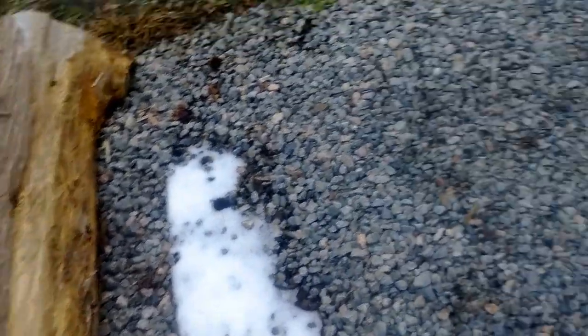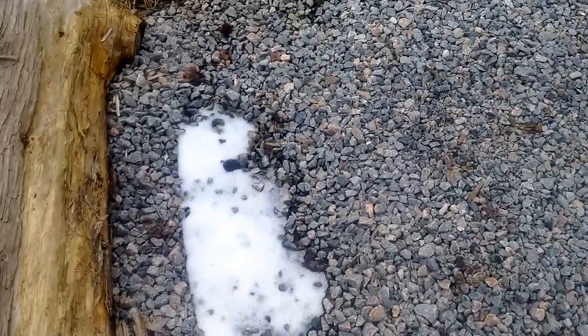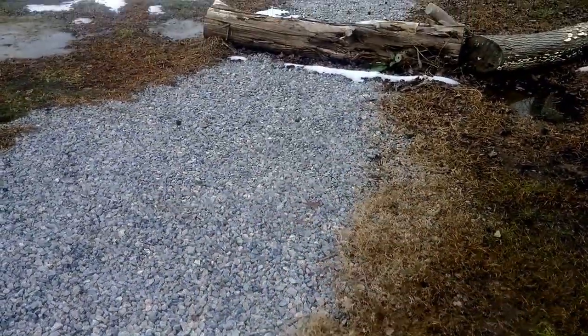The pipe is perforated. It's actually 60 feet of pipe and there's about 35 feet of it that's perforated on top, so we catch water here and catch any runoff across here. This little spot last winter, from this log over to that log, was nothing but a boggy marsh.